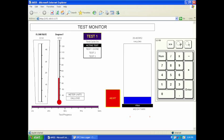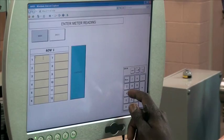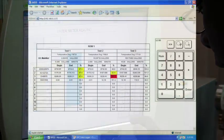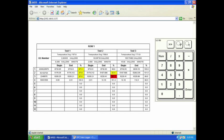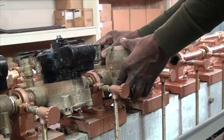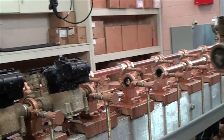When the test is finished, enter the ending meter reading. The AMS will automatically compute the results of the test. By selecting the test results button, a report will show the pass or fail status of a meter, along with its fast or slow percentage. After completing your series of tests, the meters can be released and new meters can be set in their place for the next test.